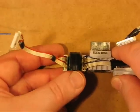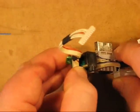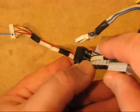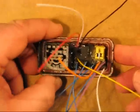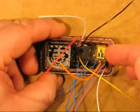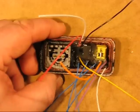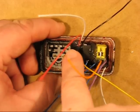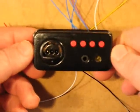This black plug is the AV connector for audio and visual. The single leg is the composite, the one nearest the end is ground, followed by right and left audio. That's been installed so far into my little adapter here, currently placed next to the recharge jack for the batteries. The four tact switches are for the volume and contrast control — there's a grounding between the two — and the alternative controller port hasn't been sealed in the box yet, but this part is complete.